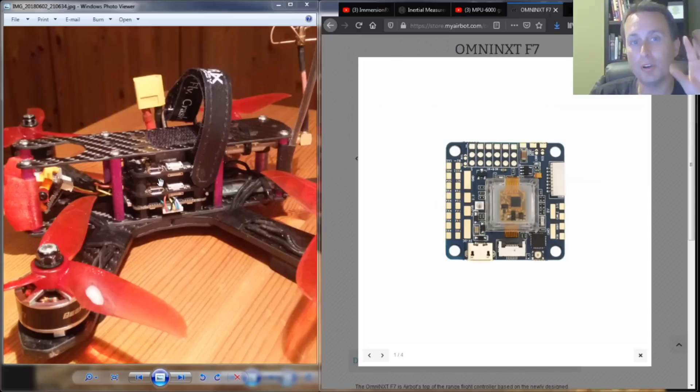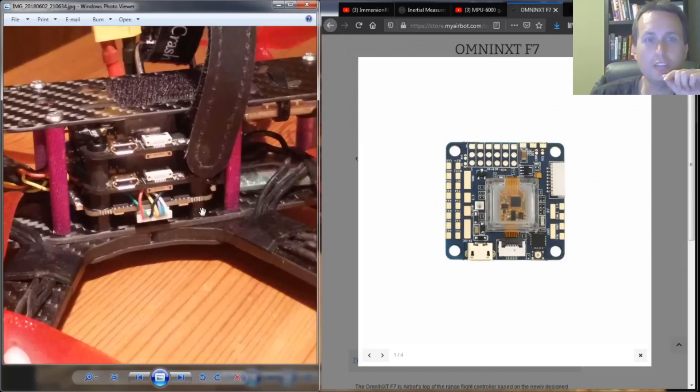With this logging setup, both boards were armed and logging started at exactly the same time, so it's recording noise from the exact same flight. One caveat: he used nylon standoffs throughout — nylon standoff to the PDB, another to the bottom board. What we found is that the higher board in the stack consistently received higher vibrations. That's why in my setup I don't use nylon standoffs; I use metal studs going straight through, which is way better.